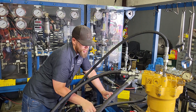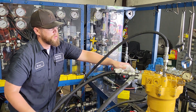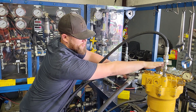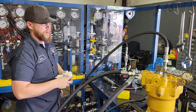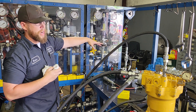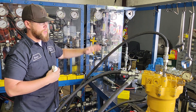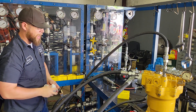Here I've got my standby pressure and my brake release pressure — there's about 480 PSI give or take on these. This here is a make-up valve; it's supplying oil when you shift it one way or the other so it doesn't cavitate the unit — about 50 to 75 PSI here. We're going to be running about 4000 PSI on the relief. I've got a closed center valve back here and a pressure compensated piston pump set at about 4250 PSI. When we turn it on, you're going to see that gauge build up to 4250, and when I pull one of these handles you should see it drop down and build back up to where the relief is set in each direction.